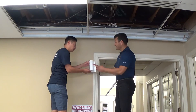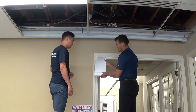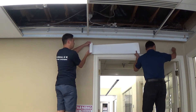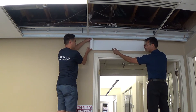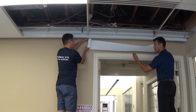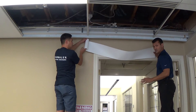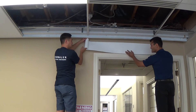We start with our roll of material — this was provided to you as part of your fixture shipment. One person holds the end of the material and comes towards the end of the run. The second person holds the reflector material out maybe five or six feet away from the end. You want to provide sufficient slack so that the material doesn't become creased during installation. Once that material becomes creased, that crease is never going to come out and your installation is going to look poor as long as the fixtures are up.